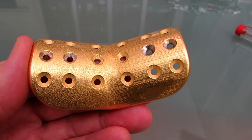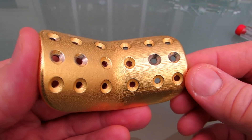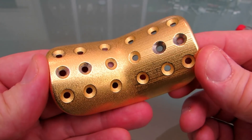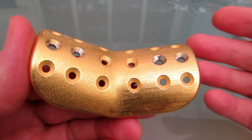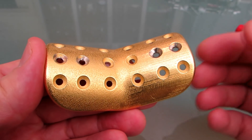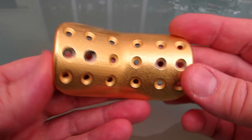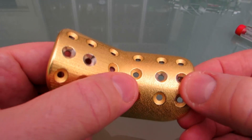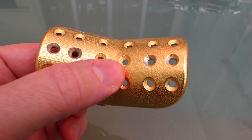This part is then finally cured in an oven, which results in another little less fragile part. Then it is dived into molten bronze, and this bronze is, through the capillary effect, sucked into the part. So this is an alloy of stainless steel, which is of course itself an alloy, and bronze, which is also an alloy.